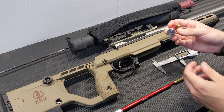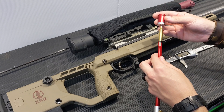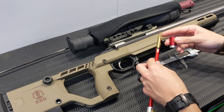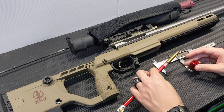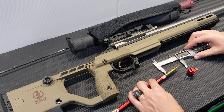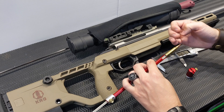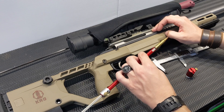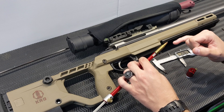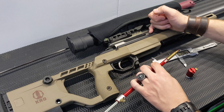If you have the Hornady Comparator set with the overall length gauge, this will sit on the ogive of the bullet. I find this is substantially more accurate, particularly because my die seats based on the ogive, not on the overall length. Depending on the quality of your bullet manufacturer, the overall length of the bullet versus the ogive might be slightly different. At the end of the day, what truly counts is the part of the projectile that is contacting the lands and grooves. When you seat them all uniformly, there should be an even amount of jump between the bearing surface of the projectile and the start of the lands and grooves — that's referred to as jump.